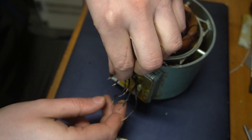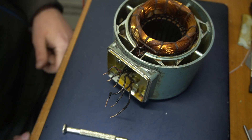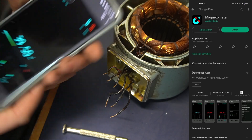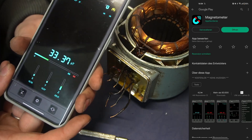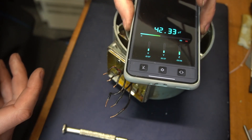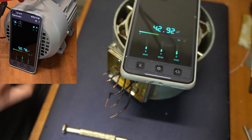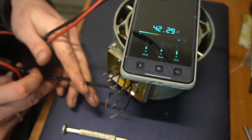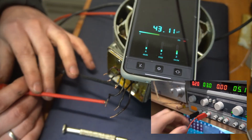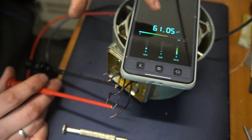In this case the different wire lengths already gave me a hint, but I want to be sure. To do this I downloaded an app which displays the reading of the magnetic sensor inside my phone, which is used for a compass for example. I then placed the phone on the back of the motor — the measurement only works when the phone is placed at either end of the motor rotor; it didn't work on the motor's side. I connected the winding to my power supply, set it to 4V, and shorted the spool with it. Now as you can see, the magnetic field is clearly visible.